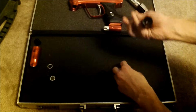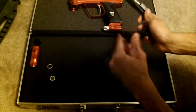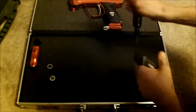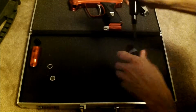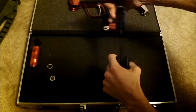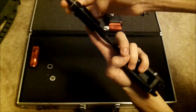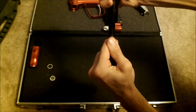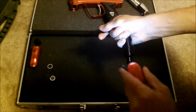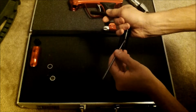You always double check, right? Put your spring in there. Make sure that doesn't fall out. Like I said, we're going to screw this back in now. Screw it all the way in and then back it out, because you have two holes for those baby screws and you want those holes to line up. So once you think you have them lined up perfectly, I actually have a flashlight so I can see in the holes. Yep, make sure they're lined up perfectly.